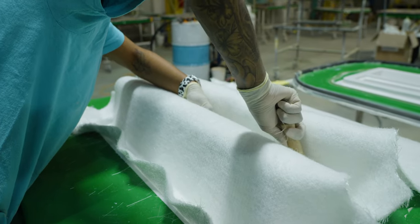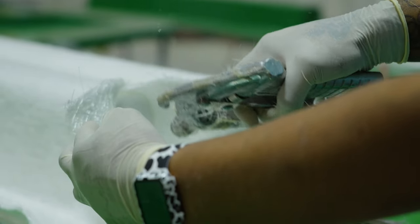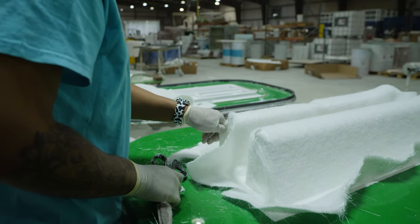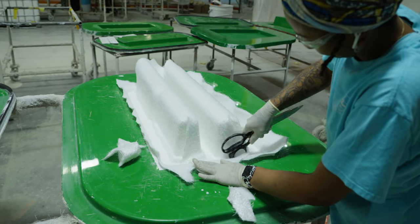Next, work can begin on dry loading the molds. This is the process of laying fiberglass and composite coating materials inside of the mold without any resin. Each light RTM part has a very specific lamination schedule designed to be of an exact thickness. The thickness matches the cavity created by the A and B mold coming together. The specific materials and amount that goes into each part varies from part to part and is determined during the design period.